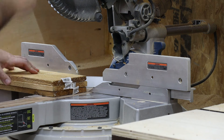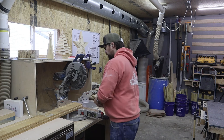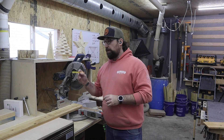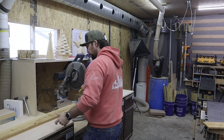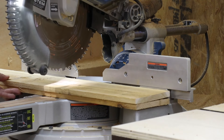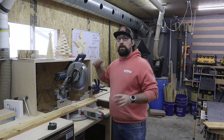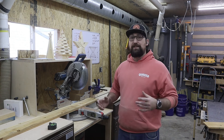You can even see that these aren't even the same width as each other. I'm going to put one of these fence pickets off to the side — we need to rip that down in a later step. Now that we have the ends cut off, I need to mark this out for 14 inches. I have two still stacked on top of each other because these are going to be identical cuts. I'm going to line this up on the saw and set a stop block. With a stop block, I'm going to make sure I have pressure on this side of the board, or make sure the blade comes to a complete stop before lifting it. If you don't, the teeth on the saw blade can get caught on the edge and you can get a kickback, which will throw the material at you or potentially damage your saw.